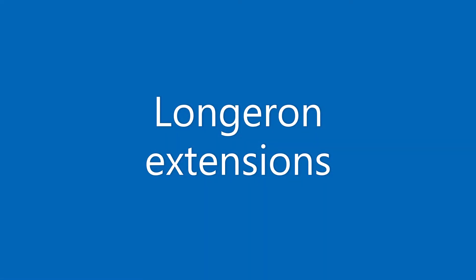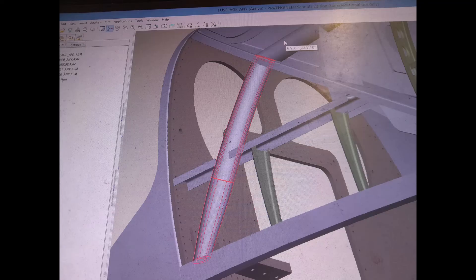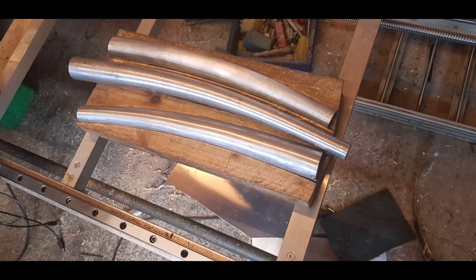The upper and lower longerons were connected via angled tubular extensions. The extensions were manufactured from tapered curved tubular aluminium section and involved a complex manufacturing process. The process required specialist equipment to spin the tube down from the larger diameter to the smaller with a uniform taper, the curvature then being applied by roll forming around a mandrel. The final form was qualified by pressing into form blocks.